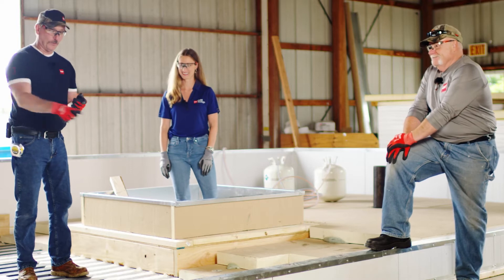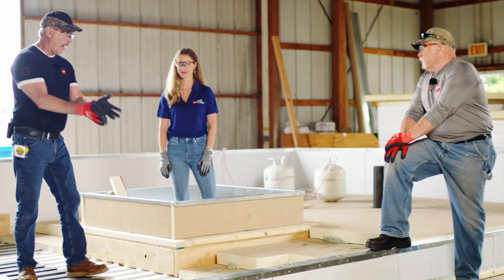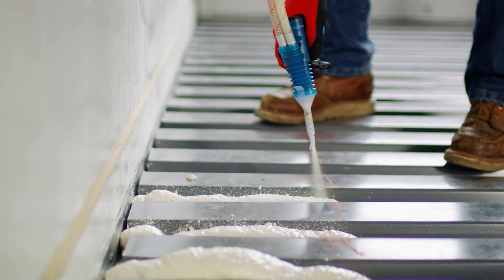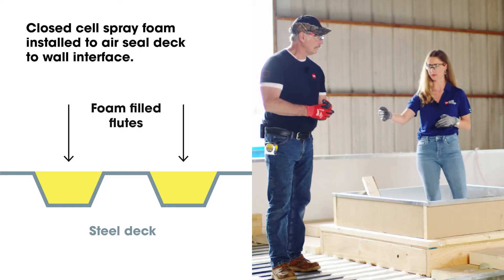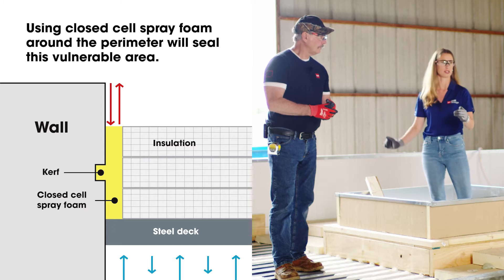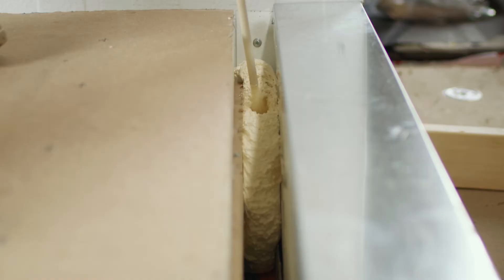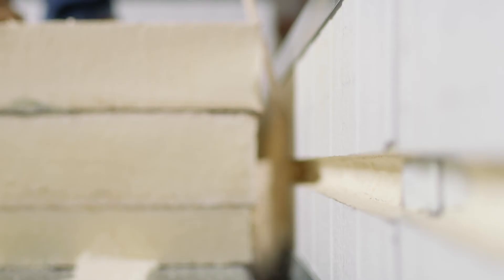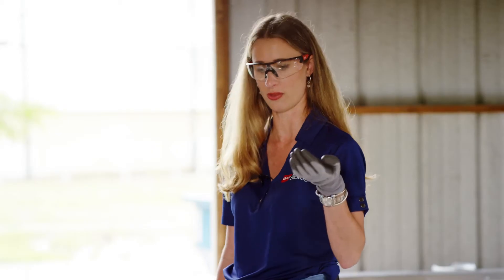In a previous segment we talked about the kerf that goes all the way around the perimeter of the building — let's explain how that gets filled. We want to make sure we're filling the flutes at least 12 inches from the perimeter of all penetrations as well as at the wall-to-deck interface. We also want to make sure we're filling at least a one-inch minimum gap from the wall to the edge of our rigid insulation, all the way from deck level to the top.